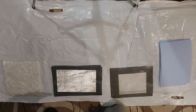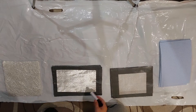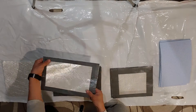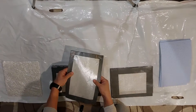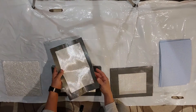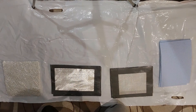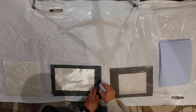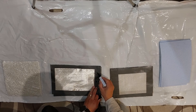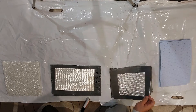In terms of triaxial mat, this will take 100% of the load but in three directions. So if we pull in this direction nothing is happening, and in this direction nothing is happening, but if I pull it like this you can see it starts to shear. It takes 100% of load in this direction, 100% in this direction, and 100% in this direction. The reason I put adhesive tape on the edge is because it tends to shear and I don't want that to happen.